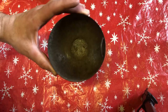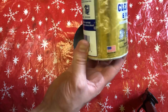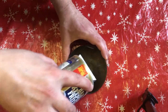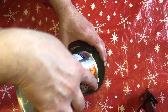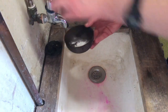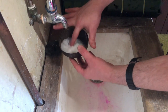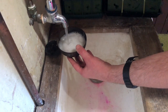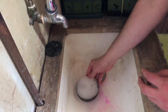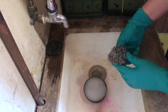Now that most of the resin has been removed, I am going to give it an extra scrub. To the fire pit I am adding some Bar Keepers Friend, a brass cleaner which can be purchased from the supermarket relatively cheaply. I am going to add some water and let it soak for a minute before giving it a scrub with a scourer. Bar Keepers Friend was invented after a chemist noticed how clean his pot was after cooking rhubarb. It is excellent for cleaning uncoated brass and in this case softening up some of that leftover resin.